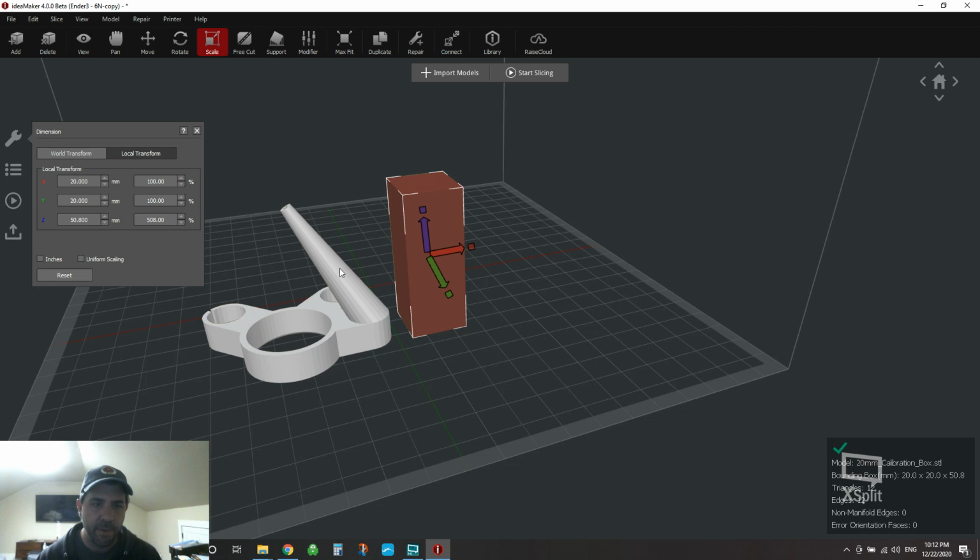And so what's going to happen is once it does this layer, it's going to come over here and do a layer. It's going to do a loop around this guy. And the bigger your artifact is over here, the cooler this is getting, right? So you have better odds now of this small feature up here forming well, because you're taking heat away from it and moving it over to your artifact. You don't care what this thing looks like, right? It could look like a melted brick by the time you're done. Who cares? It needs to be doing its job, which is basically heat sinking and pulling heat away from your part, giving it time to cool.